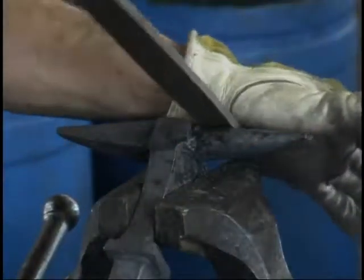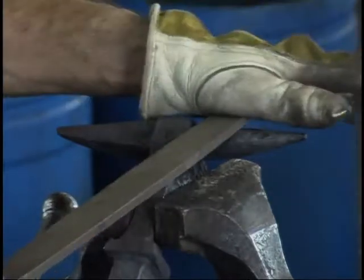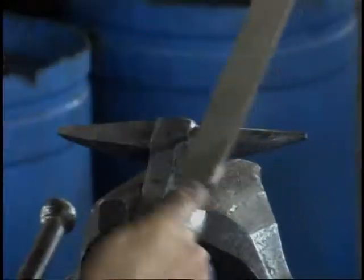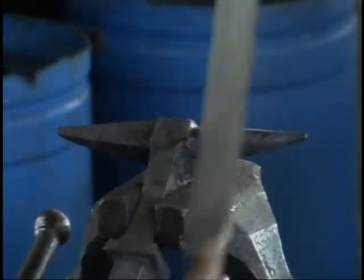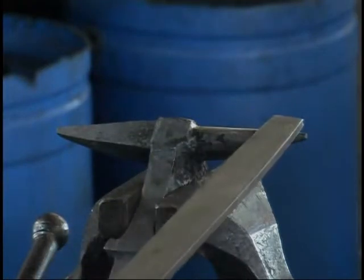Yeah, make nice and round. This is great for working the ridges off, holding the file in a plane, going forward and cutting in a plane. But then for finishing, rock it nice and smooth. Dan helped me with that last time around I was doing this. I like doing it at the base first and getting that run coming out here.